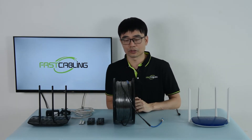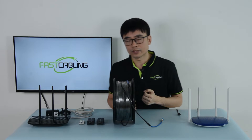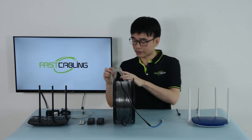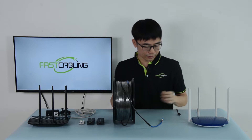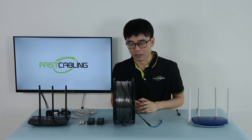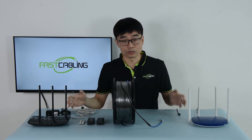In this video, I'm going to show you how to use the fiber optic cable. The fiber optic cable provides fast speed, long distance, and low latency. The maximum distance for the copper cable CAT6 is about 100 meters. If the distance is over 100 meters between these two routers, we need some kind of extension solution. With fiber optic cable, we can have like 10km between these two routers.